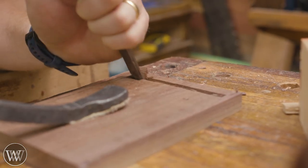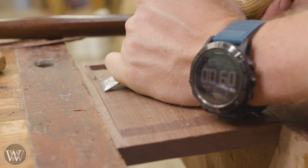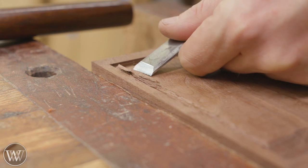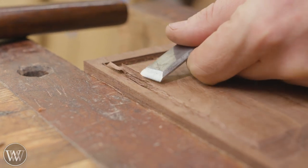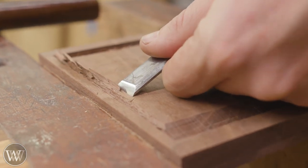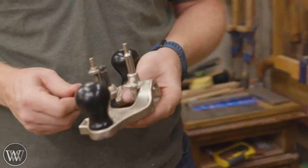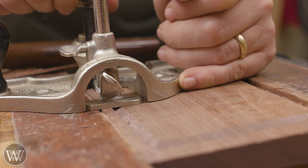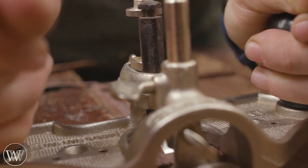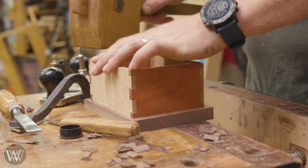It's going to be a lot of repeat: chop down, pare out. And while that may sound familiar if you've watched my channel before, that's really the basic of all woodworking. When you go with the grain it's kind of fun because you get this whole splinter that pops out, and every time you go down a little bit deeper the splinter gets a little bigger. Now you'll notice that the groove I'm making on the inside I'm just leaving it rough — not actually making it a quarter inch wide to fit the box — because no one is going to see inside the box. Nothing is going to be stored inside except for electronics, and the box will automatically close itself when you flip the switch. To make sure all the bottom is equal all the way around, I'm just going to bring in the router plane and plane it all down to surface.